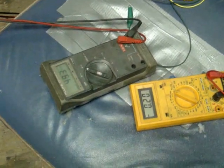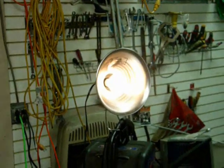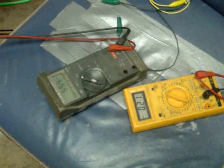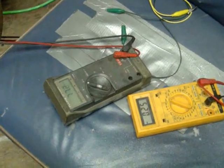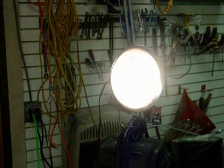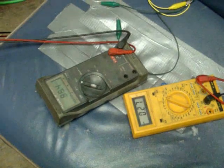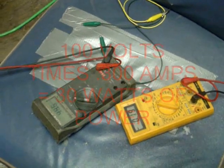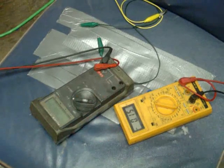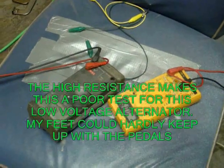Let's speed it up just a little bit. There's 50 volts — look at the amps. Let's get it up to about 75. There's 75 volts, looking at 250 milliamps. The light looks like it's on full brightness. We'll crank it up to 100 — looking at 300 milliamps. The light wants to roll, but we're at 300 milliamps and 100 volts, so we're only doing 30 watts. You can't pedal any faster than that. It's got more of a flywheel effect. Like I said, it's not a good test. You need something with a little lower voltage, so we're going to play with something else.